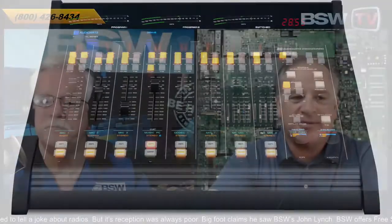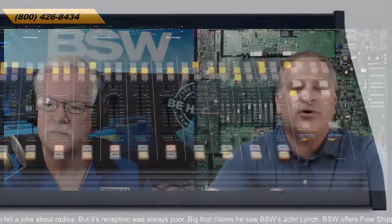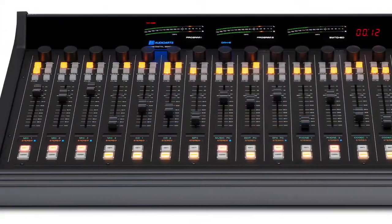The DMX also comes in either eight faders or 16 faders, so you've got a good mix on how many things you need at once. When talking to customers about AOIP, one of the first things they ask is why you'd want a 12 or 16 fader console. We sort of ask them: how many things are you going to mix at once? Because these are router-based boards — you can have snapshots and change scenes. We're seeing the actual fader count and physical surface in the studio get smaller because the back end of AOIP technology allows you to route any source to any fader at any time.